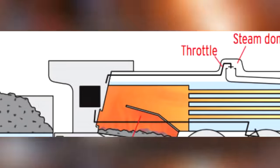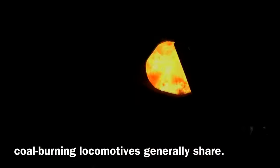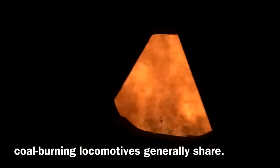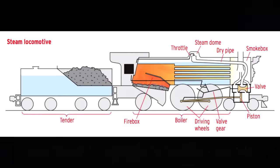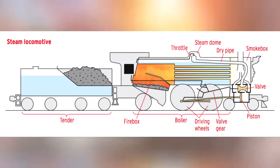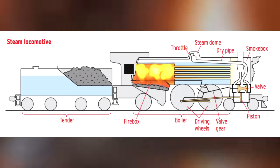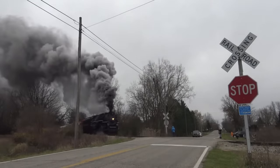This is why in almost all steam locomotive diagrams you will always see water sitting just slightly above the top of the firebox. This is an absolutely crucial detail — the water acts like an ice pack, covering the firebox on nearly every side, keeping it cool and within operating range. However, if the water gets too low, the exposed parts of the firebox are subjected to the full force of the fire, quickly heating up the steel.